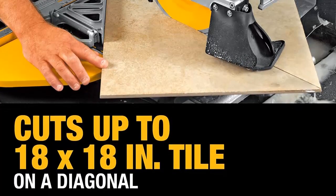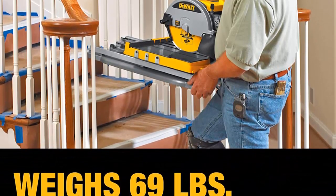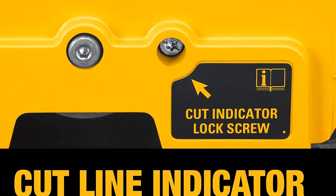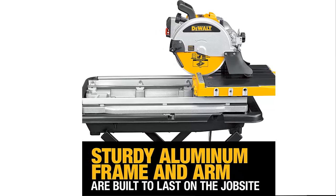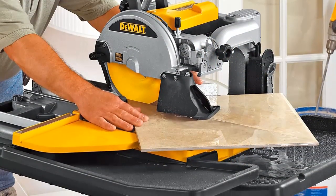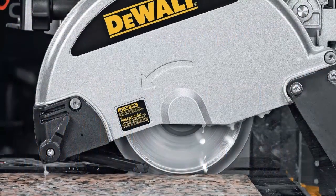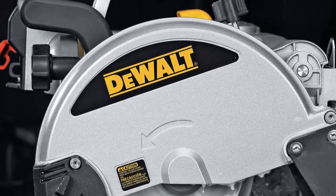When tackling large projects, you'll appreciate the 24-inch ripping capacity. Two adjustable water nozzles allow for correct positioning of spray on the blade, while optional rear and side water attachments capture overspray so water stays in the 5-gallon pan. A 3-1/8-inch depth of cut gives you the option of cutting the majority of V-caps and pavers, and an edge guide with dual-position 45-degree guide makes it easy to line up corner cuts. There's also an efficient 1.5 HP motor, a flip-style edge guide for 90 and 45-degree setup, and a tub-style bottom with four molded sections that fit into the included stand. The fully integrated durable stainless steel rail system ensures precise cuts every time, and the removable cutting cart gives you better access for quick cleanup.